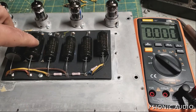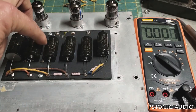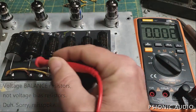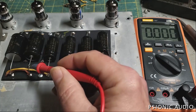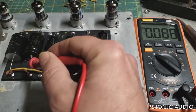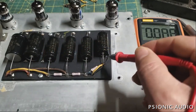In this amp we've got two 350-volt caps in series with voltage bleeder resistors in parallel with each, which force each one of these capacitors to handle exactly half of the maximum voltage. The two in series means that these can handle 700 volts total — 350 volts per capacitor. Subsequent capacitors can handle 500 volts.